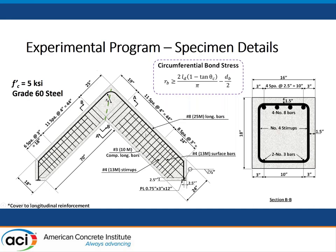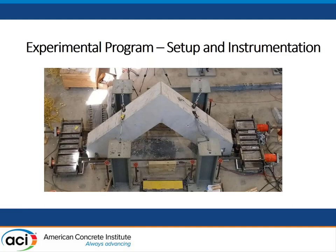After a long time curing and building, we set up our test frame. The test frame is composed of two steel crossheads. Between these two crossheads, I used tensioning rods to make a self-reacting system. On one side I put load cells to measure the load, and on the other side I use hydraulic cylinders to apply loads to the specimen. The load is applied horizontally to create closing moments in the joint. I also put four columns of a bracing system to prevent any accident such as toppling of the specimen.